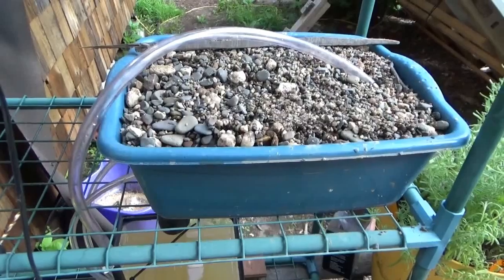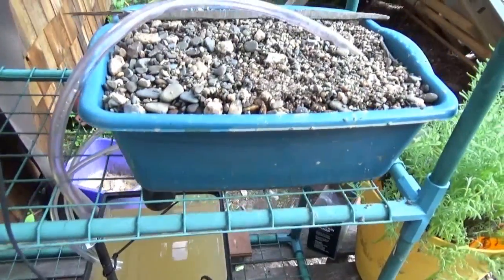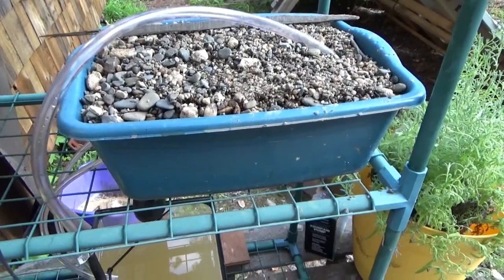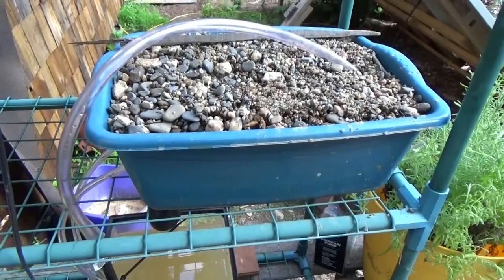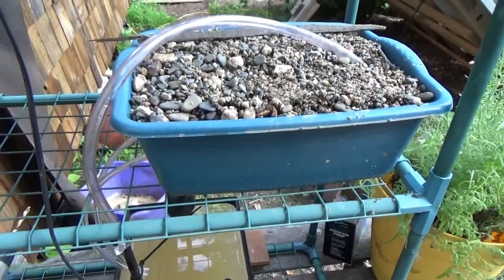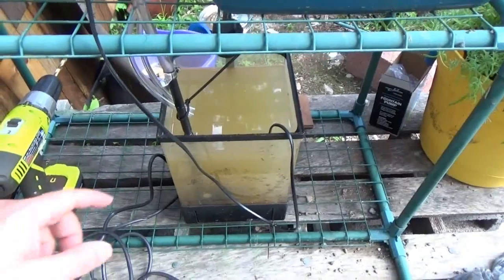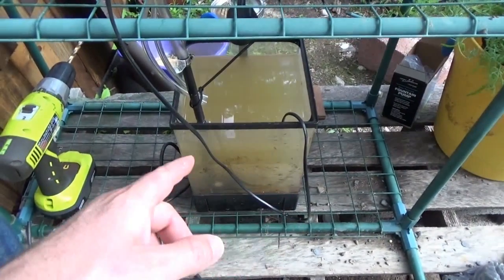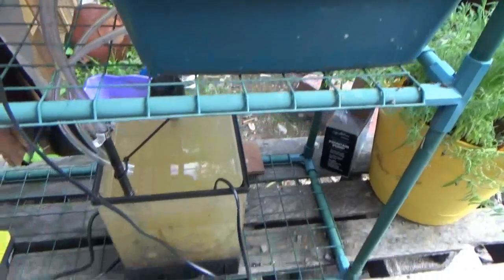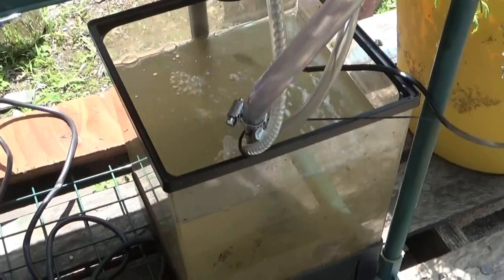The sun is down and the water has stopped flowing for the day. The water has cleared up pretty decently — a couple more hours of running and it'll be clean tomorrow. I want to dig up some plants and get some lettuce or something growing in here. I'm going to put a six volt battery down here, since it's a six volt pump, and run the solar panel to the battery and the battery to run the pump so it runs day and night. Eventually I'll put a timer on it so it runs at a 50% duty cycle.